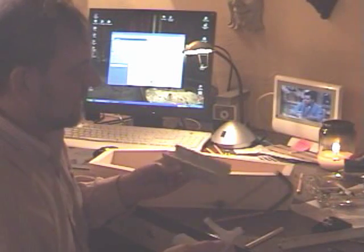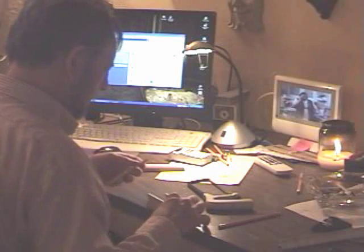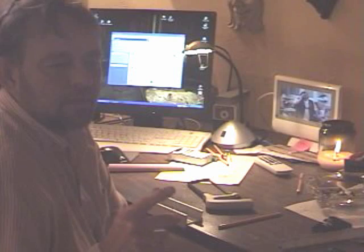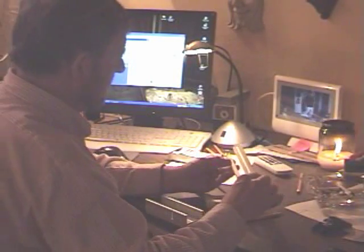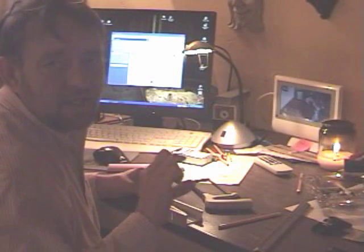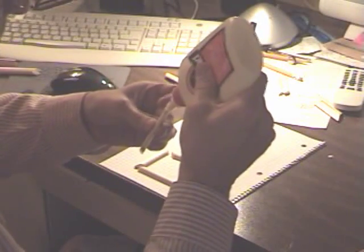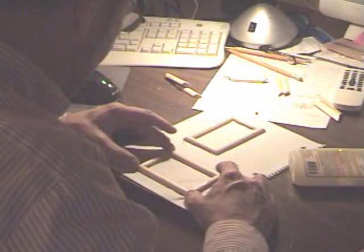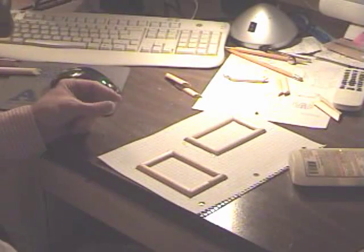The tool I found for this was perfect — a tiny mitre box from Menards, about six dollars. The chop saw ends up breaking those. I cut 45-degree miters on all my little raised panel pieces and glue them on. Since we have a six-sided coffin, to do raised panels on each side — two per side times six — we need 12 that are all the same height, about two and three-quarter inches on this one. We only cut different lengths; the up-and-down measurement stays the same. I'm gluing them on graph paper to square them up, then eyeball-center the panel onto the coffin side. When the glue dries, just peel the paper off.